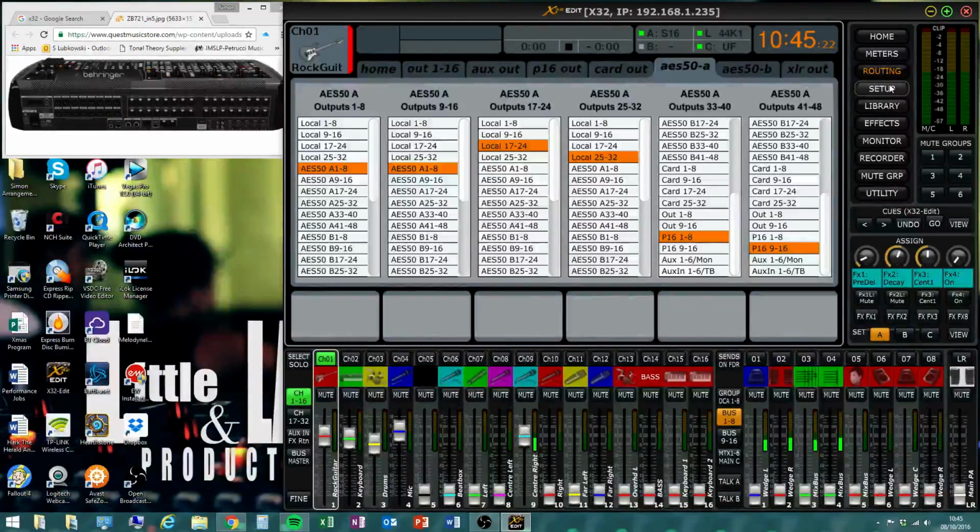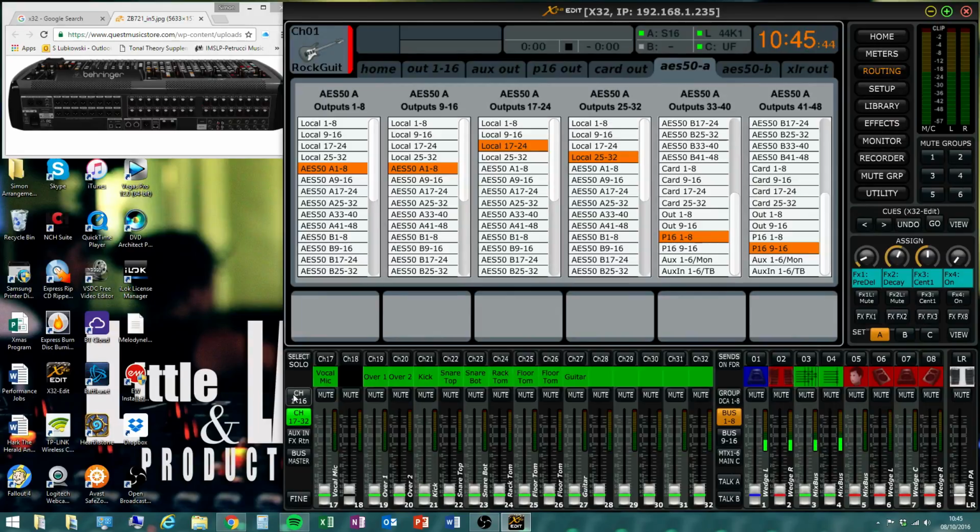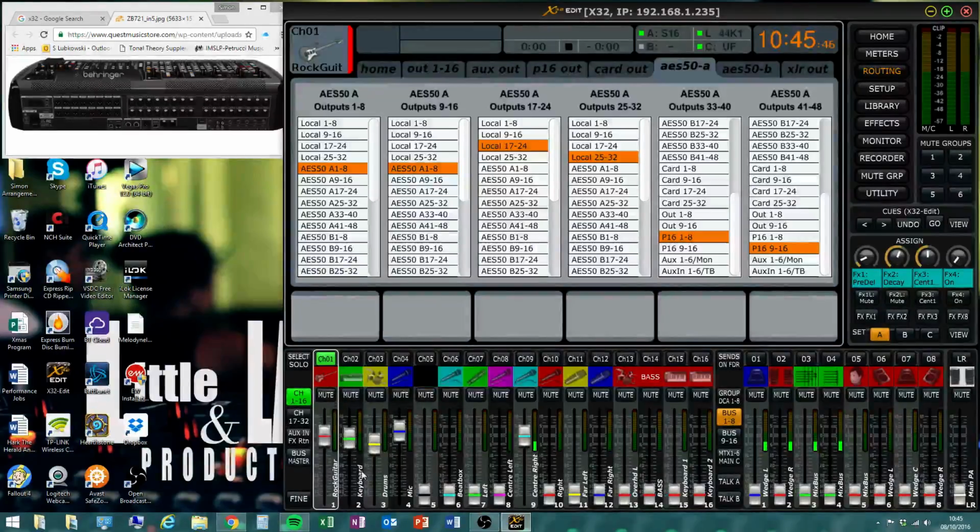The positive is that with a digital mixing desk, you can actually do a lot of your settings beforehand, save it, and then reload it. And you can do individual scenes. So you can actually save individual scenes. For example, if you know for a certain song a keyboard gets used, but for the other songs it doesn't, then you can set it at the mixing desk so that at certain songs that's what those settings look like. But for the next song, if you just go next, there's the cue, next song, you've already set up that setting and saved it.